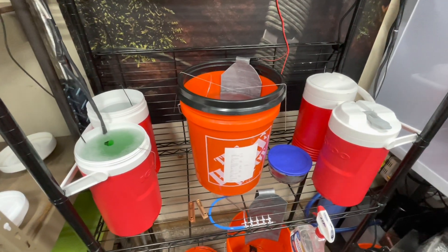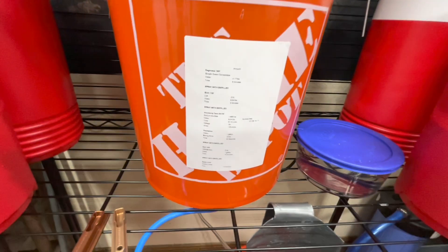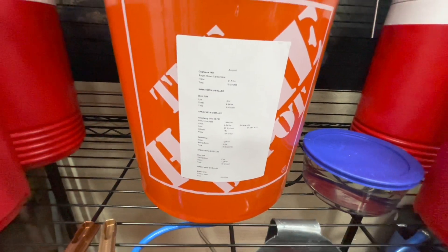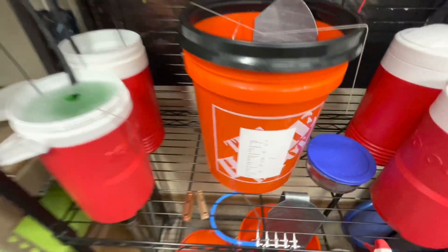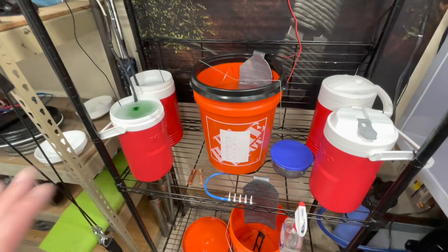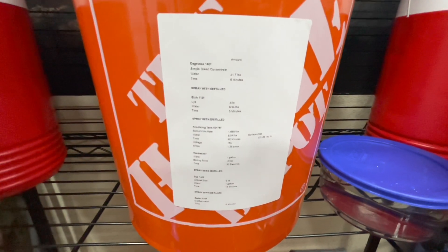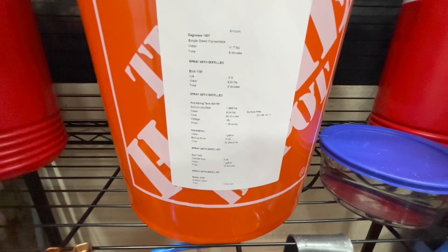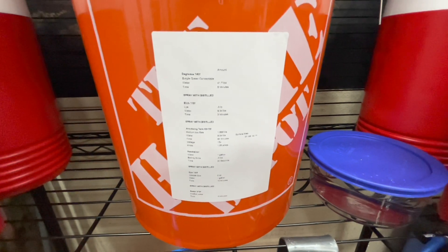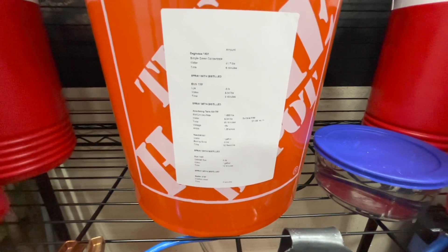It was actually technically too warm today — about 85 degrees, and that's just a spring day. The parameters are: 140 degrees for 5 minutes in Simple Green; 110 degrees for 3 minutes in lye, though I found that a little much — I didn't even heat it and when you put an aluminum piece in there it eats it, you can see bubbles forming like crazy, and it etches in just a few minutes cold, so I'll have to revise that. For the anodizing tank: 15 volts. I've heard some people say you're supposed to use constant current, but I've seen others say just let it draw as much current as it can at constant voltage, and that's what I've done — seems to work.